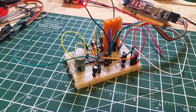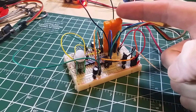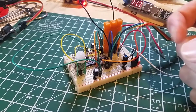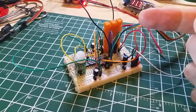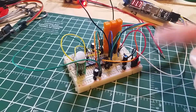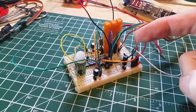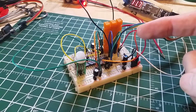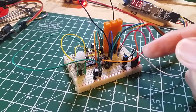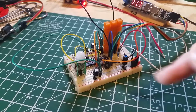Welcome back. A little bit further along, I did get that ESP module, the version 1, into the Terminator-like CPU casing. It puts it to 8 pins in line, so it'll go straight down into a breadboard, as you can see. The only things I've really changed on this board since the last time it's been on is the layout for this. Now, instead of being the way Hari had his and the module he sent me that had the 4 pins on either side of the split in the breadboard, it now fits 8 in a line. So I just moved the pins around for that.